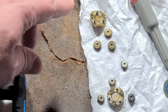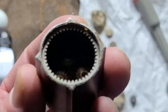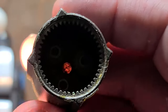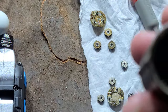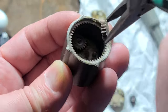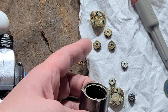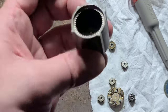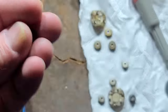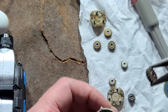To get the super low 300 or 175 RPM and give it enough torque, that motor spins fast. This is actually a triple reduction, or triple-stage planetary reduction gearbox — one of the relatively rare ones. The gear sizes on the first stage are a little bit smaller than the second stage. The second and third stages appear to be identical planet gears. I have to use tooth pliers and actually yank these gears out when they should just be falling out.